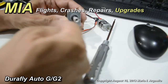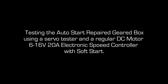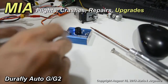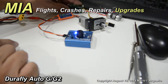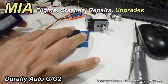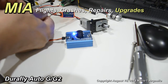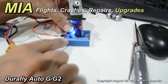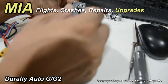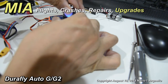Make sure that part spins freely counterclockwise. I'm using a servo tester to test the unit outside the model with the speed control that I replaced the original electronic soft start switch with. It's connected to a battery using the same JST connector so I can make the connection. When I use the potentiometer on the servo tester I should get it spinning counterclockwise. I can hold the unit with my hand, put a little pressure, and see how it holds — and it's holding.